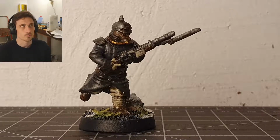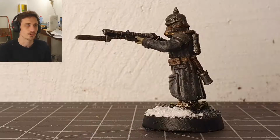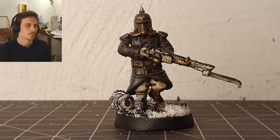So at first I tried upping the amount of bottom layers and the exposure time, and really all I got from that was that I ended up upping the exposure time on the bottom layer so much that it got stuck on the plate, and I broke a spatula getting it off. So instead I sanded the surface, and so far that looks like it's working pretty well. Very carefully, by the way.